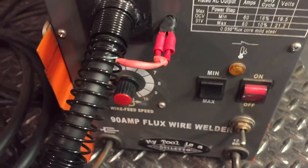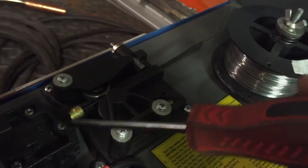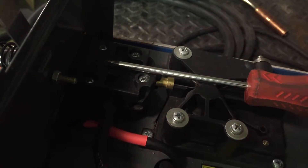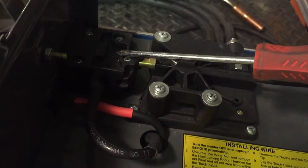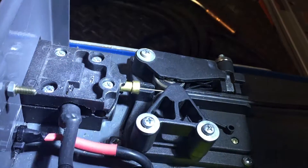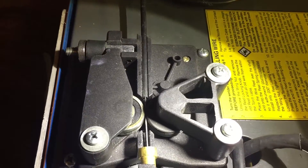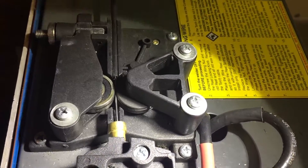The connection was a bit of a pain in that the cable basically runs through here and it's sandwiched in this plastic block. What you have to do is dremel out this area to fit the brass connector that's resting in here — it's a threaded brass connector that you clamp with a ring clamp, and that's where you draw your power from. All that plastic block does is sandwich it in, and the real key is to line it up with the wheels of your feeder. Once you can do that you'll be fine — once you get the wire fed in there, it works well.